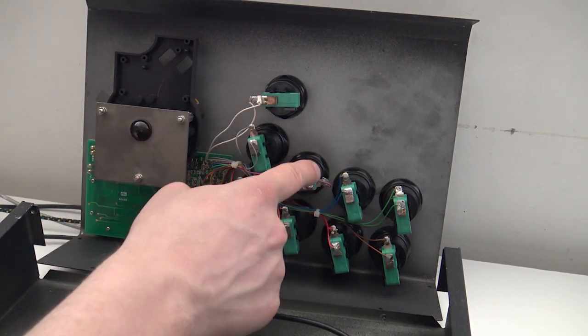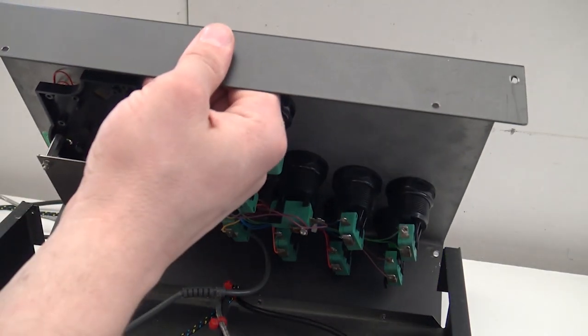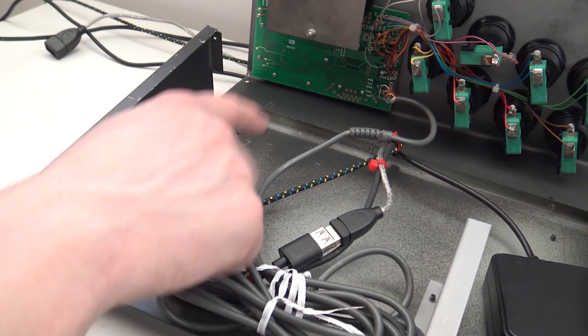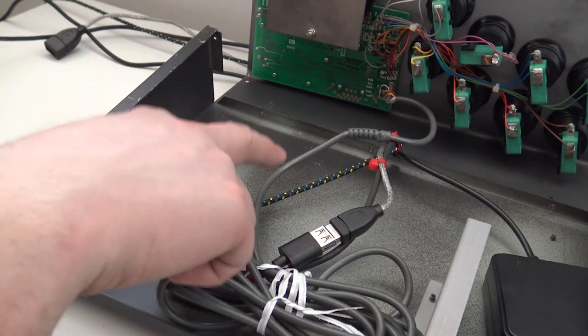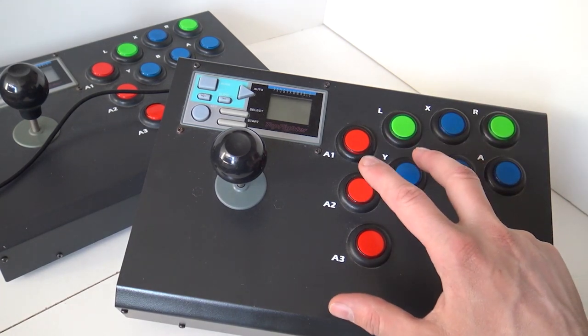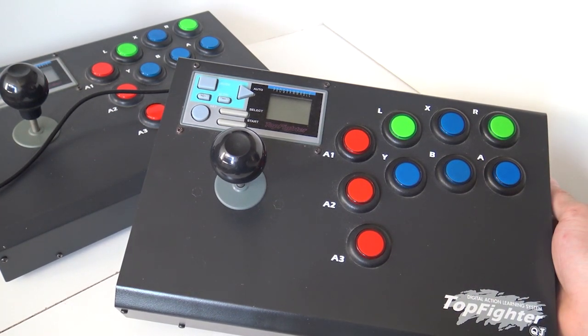What I really like about this joystick and what makes it feel more authentic is the old-school micro switches. You can see the very thin wires — you need to be careful while putting it back together. You can also see the spring itself; this is real old-school stuff. For people thinking you need to get a Pi 3 or Pi 4 in here — you can see the metal blade that holds the joystick together takes up a lot of space. There's not much room left. It's a little bit of a squeeze even for a Pi Zero, and there is definitely no room for a Pi 4, Pi 3, or a Pandora box.